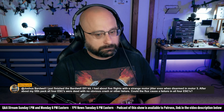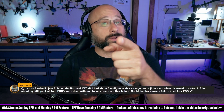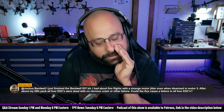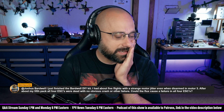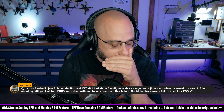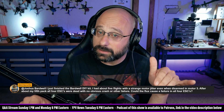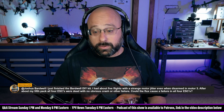He said it's H2O water-soluble flux — not labeled as no-clean, but I'm not familiar with that one. So if it doesn't say no-clean, here's the thing: I don't want to just say 'it's your fault, ha ha.' Because I've seen these ESCs die for no reason. What I would do is go to GetFPV and say, 'Hey, I had a problem with this ESC from the moment I plugged it in, and then on the fifth flight it just died for no reason.' Don't mention the flux. If they ask you about the flux, be honest — but don't mention the flux. Just be like, 'Hey, what can you do for me?' Maybe they'll send you a new ESC. And then either clean the flux off or use no-clean flux.